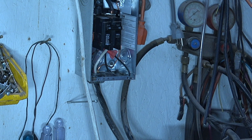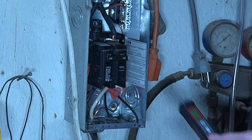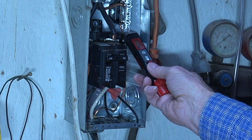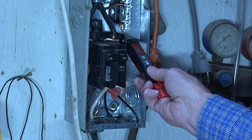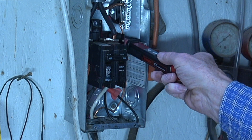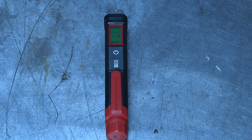You can check wires with these things. If I go up here to the ground, I better not get anything — it's beeping here, but that's because it's close to this other wire. So it's a good tool to have in the box — quick check for voltage, AC voltage only. Non-contact voltage detector means it does not have to contact any hot leads in order to work. And that's it on this one.